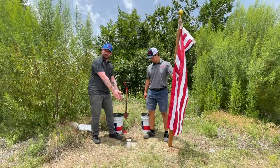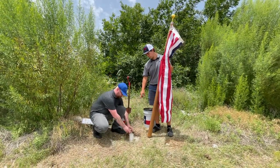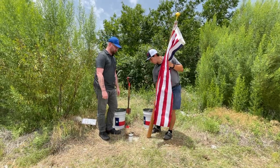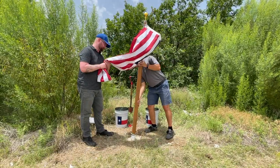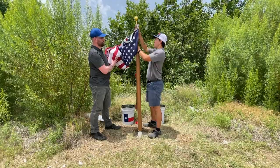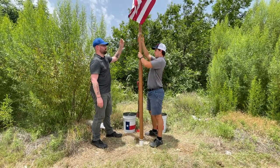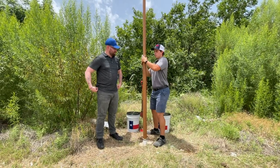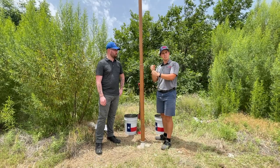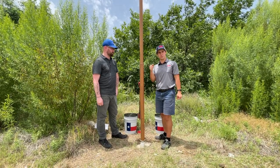Our concrete is set and everything's ready for us to install the pole. There's actually a small clamp included with these ground sleeve components. It's intended to slide over the sleeve and clamp down around the pole so you're mitigating any additional water that could leak in. Once that's on, slide your pole into the ground sleeve. It's always good to have an assistant so your flag does not touch the ground. You'll start with the top section first and raise until you get to the bottom, interlocking each hook before starting the next section. That's the major difference with Concord Telescoping Pole — the interlocking metal hook system. It's much more durable and holds together much stronger than the compression sleeve or push-button components you'll see, which can be difficult to operate when exposed to the elements due to corrosion. We don't have that problem.